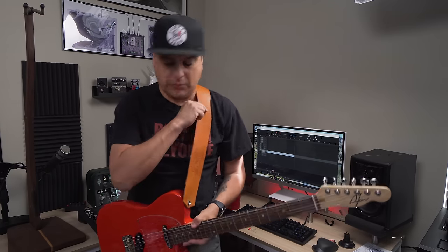Okay, now we're gonna do, this is kind of the extreme, but we're gonna do the same exact thing, but we're gonna do it with the tone all the way off. So this is volume up, tone all the way down with a capacitor that's 0.015, and the screen will be labeled and we'll play the same exact chord progression.